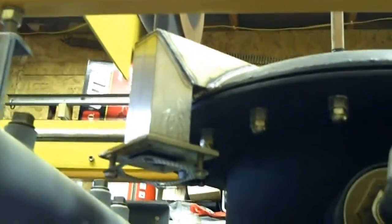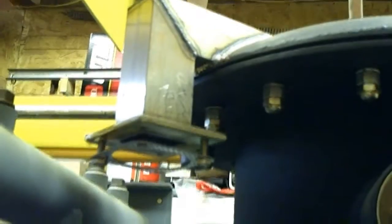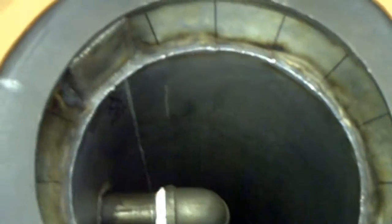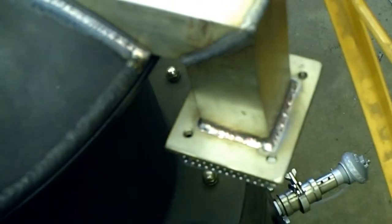I have the cap off over there and the lid open up top. Let's take a walk over and check out the input side of the pyrocoil. The exhaust is going to travel in — you can see there's a gasket hanging there. Just for the record, this is the part number for that gasket from Advanced Auto. The input of the pyrocoil is here. It goes down into this vessel that's inside the hopper and travels up and down until it travels out the other side, down and out the bottom to another flange.